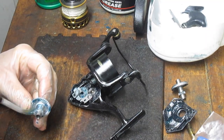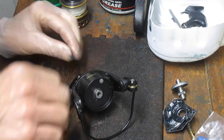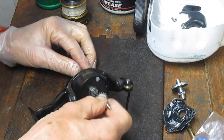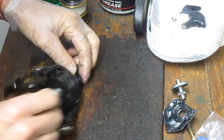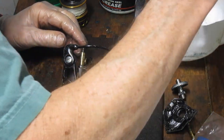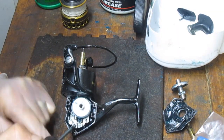Dave, I think you'll be happy with the results. You're probably better off than you were considering what you've put out versus the value of the reel at this point. These reels will last a long time if you keep them tuned up and don't abuse them — probably a general statement about any reel. What I just did was insert the axle shaft through the pinion gear and align the screw hole in the crosswind block. That's a D-shaped block, so it can only go in one way. Now I'm looking for that little flat-head screw so we can attach the two.